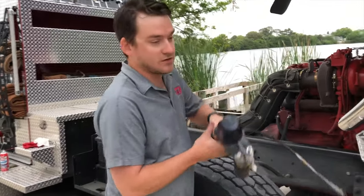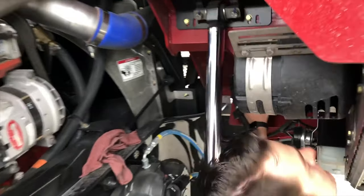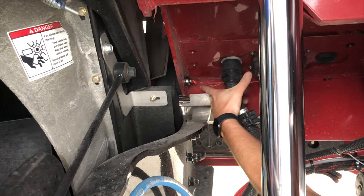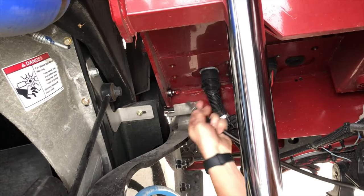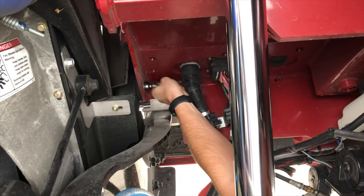So you're going to get your grease gun and you're going to slide on down here and you're going to find your cab pivot pin, usually located up in the front. You're going to pull the cap, put your grease gun on the zerk fitting, and then apply roughly three seconds of grease.